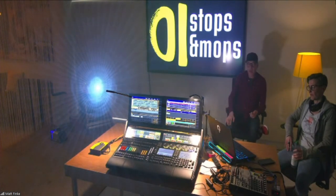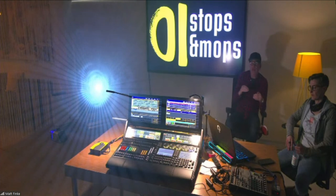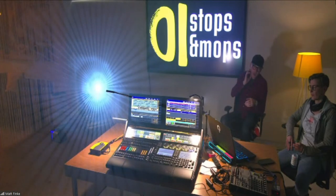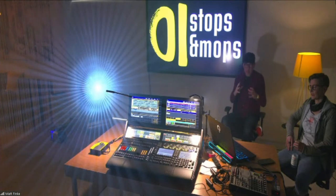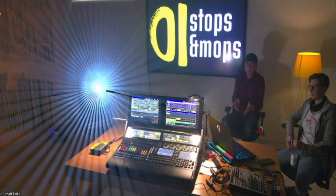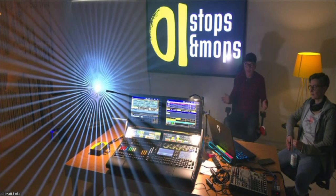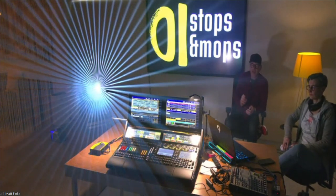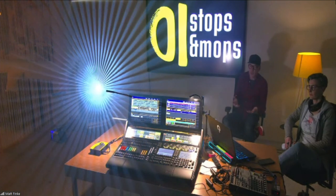Yeah. We limited it to three beams coming out of one system. This, on one hand, gets a performance insight. Secondly, every library, if you look to the functions that we're going to show soon, the functions are always the same on each lighting layer. And that means you have a lot of possibilities what you can do with one output. If you think of a generic spotlight, an intelligent spotlight, there's a lens system inside. It means the beam always goes through the same lens system. So if you only create one beam at a time, it doesn't matter if you have like three gobo wheels or 16 gobo wheels inside of a lighting fixture. But we can deliver this coming individually controlled out of one lighting source, three individual layers. So individually controlled lighting beams. That means you can do a mid-air effect while at the same time using a different output to light up your artist, for example.